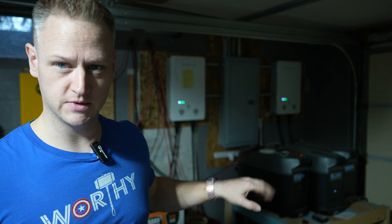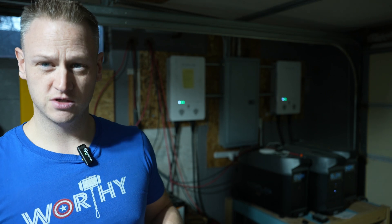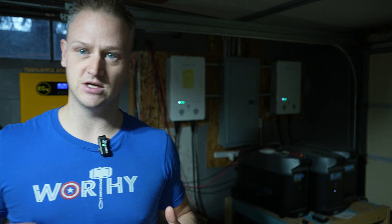I want to use thicker gauge cable, just to be a little safer, and clean up some of the loose connectors. Then I want to pile on more solar into the EG4 controller. The step after getting two Delta Pros running would be to increase the battery bank — I've only got essentially five kilowatt-hours here, which works but I'd like a much bigger bank feeding into the Delta Pros. If I have enough capacity to keep the Delta Pros topped off continuously, they're enough to run my house.